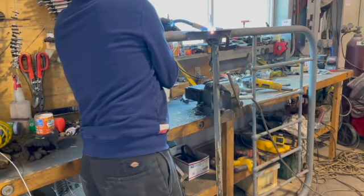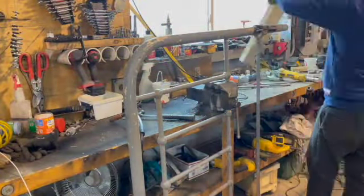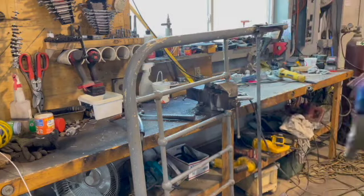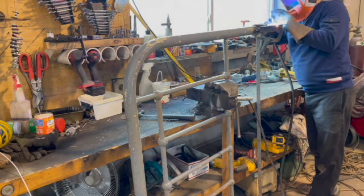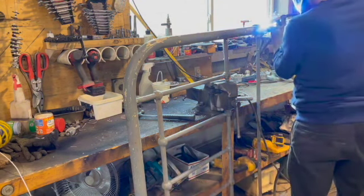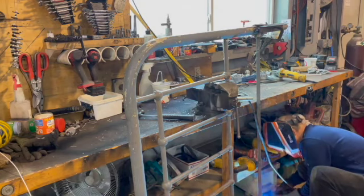Although I'm not an exceptional welder, you can see that I was getting a good red glow on the opposite side of my angle iron. Thus, you can see that I was really melting both my spacer and my angle iron, and it should never break apart. With welding, the best thing to do is to practice and try to keep a good bead going, and here I had a lot of fun. Of course, it's easier to do horizontally than to do up and down or even upside down. That might be a bit beyond me.